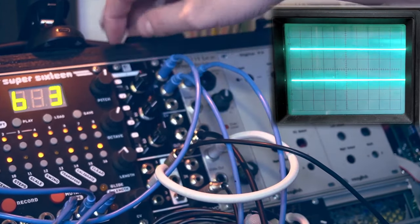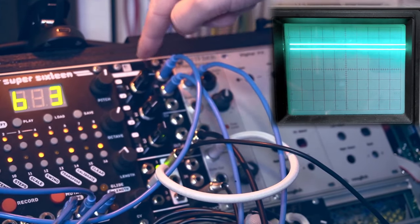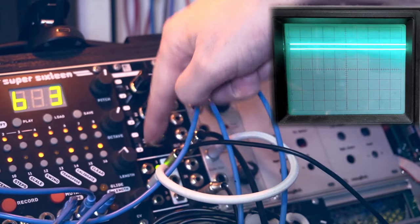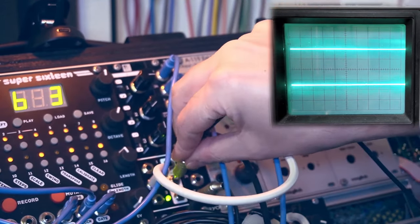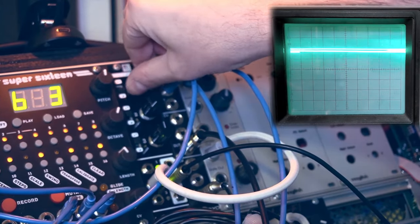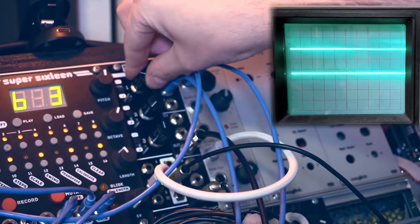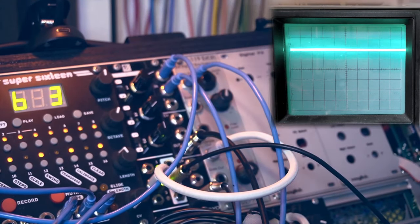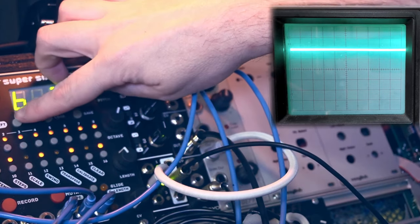And we'll use this one in unipolar mode, and we'll generate an offset voltage here. So we'll add some positive voltage component to the input, which will then get mixed together with our kick drum envelope follower. And so now if we send that, we can just control the offset of this top envelope, so that we don't start at 0 volts, we start at something like, say, 5 volts, and then when we apply this kick signal, it goes down towards 0 volts.